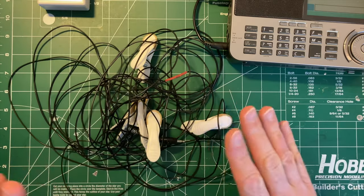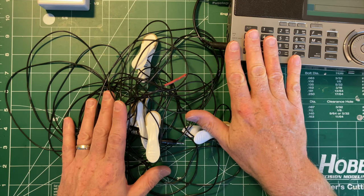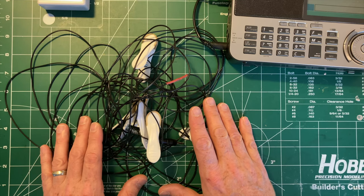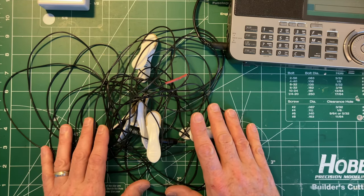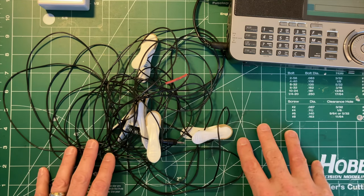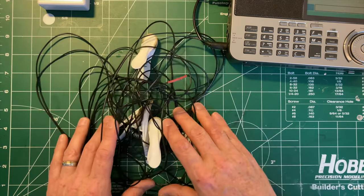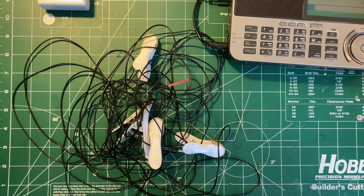The other problem is that although there was lots of signal with this antenna — certainly more than enough for the Sangean — it's not directional. And this is a very dense living environment with a mixture of industrial and business use, rail lines, and major construction projects. There's a lot of noise coming from the power cables in here, but also from outside. It would be useful to have an antenna that was at least slightly directional so you could tune it to the quietest direction available.